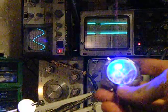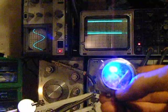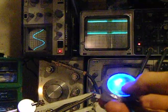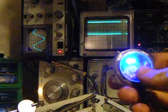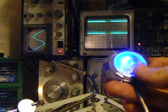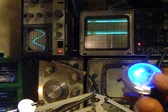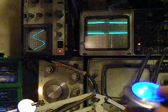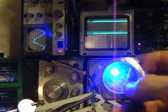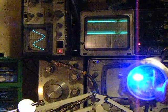Initially I just wanted to put a mic and an LED inside of these, but because of the high impedance of the contact mic and how tiny the signal was, by the time it got down the line most of it was 60 hertz and some AM radio stations. I wasn't too pleased with that, so I built two-stage approximately 40 to 60 times gain in each of these. That's about two bucks in parts.